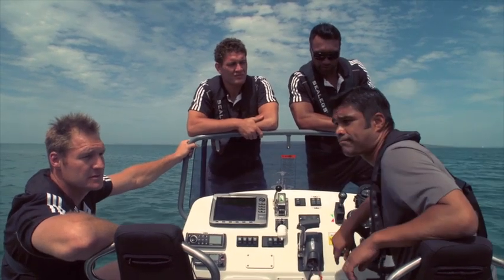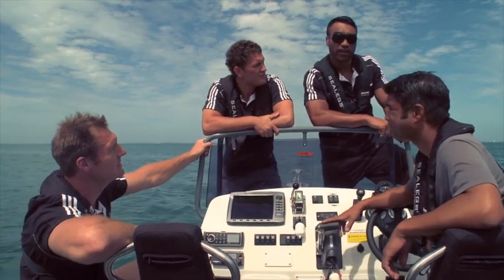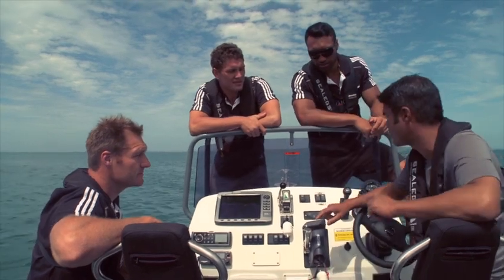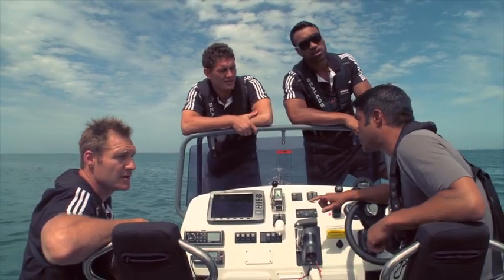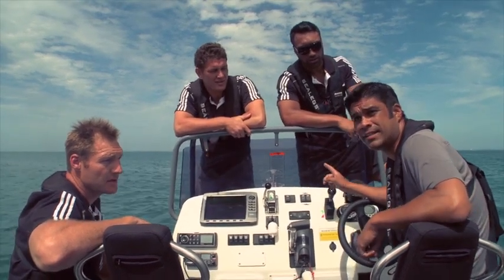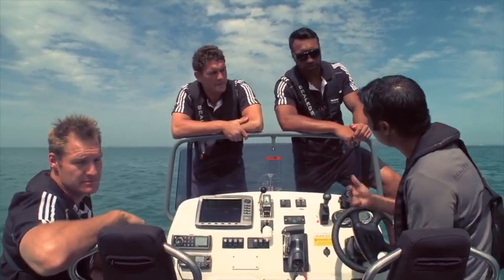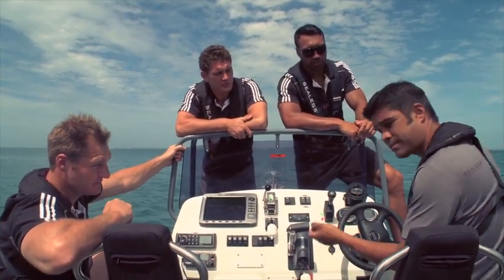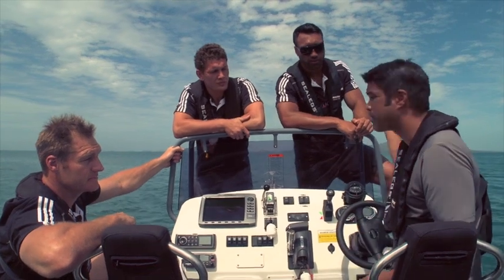We're out in the water. Any other questions? I didn't really see when you came out, so I'm just wondering what wheels come up first. That's a good question. When you're driving into the water, you get your bow wheel up first. That reduces the drag immediately and keeps the stern wheels pushing you along with the prop. Now as soon as you feel the stern wheels lose traction, get those up too and propeller away.